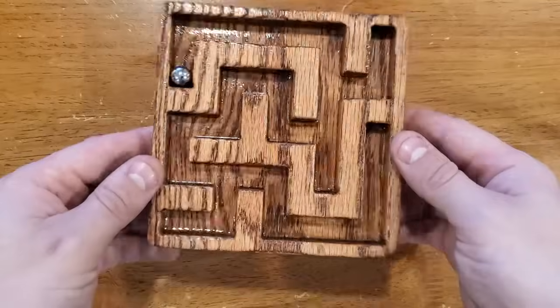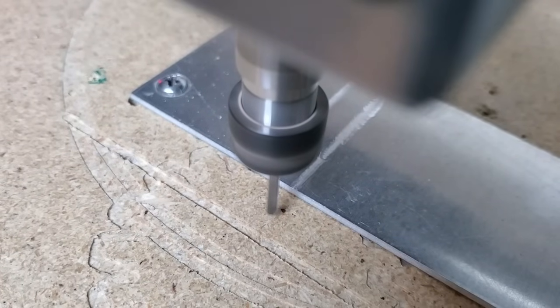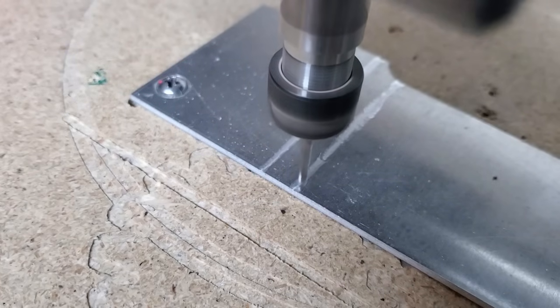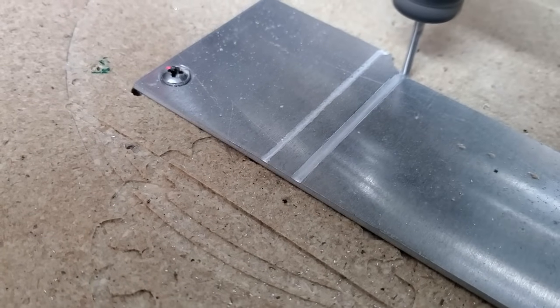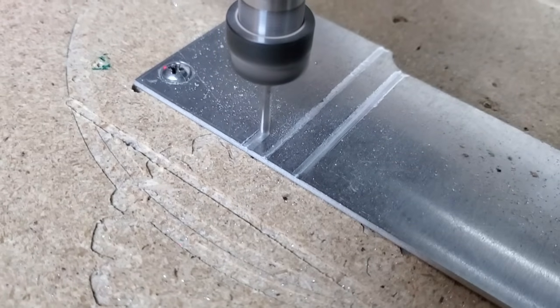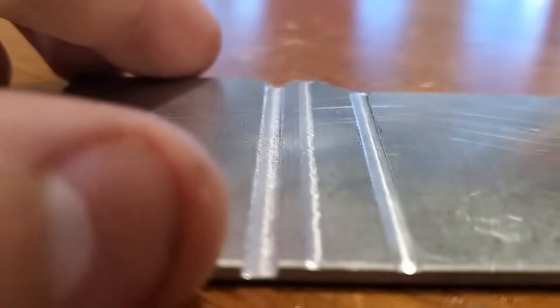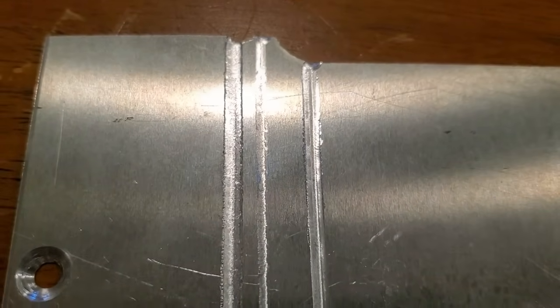I'm almost certain it won't cut steel, but it can probably handle aluminum, so let's do a few tests. This is a sheet of 6061 aluminum. I have a 2-flute 1/8-inch end mill running around 18,000 RPM and a cut depth set to 0.2mm with a feed rate of about 100mm per minute. The moment the tool contacts the metal, the head pops up and the cutter is just barely skimming the surface. Then when it comes out the other side there's a very nasty thump as it pops back down to its original height, so there's definitely a problem with the rigidity of the machine. The same thing happens with the cut depth set at 0.4mm, but this time it actually does take a bite out of the material and you can hear and see it cutting, though it's even more violent popping off the material. The spindle and stepper motors definitely have plenty of power to cut through the aluminum, but the amount of play combined with the vibration of the cheap spindle motor caused the tool to rattle around, making a very rough cut.